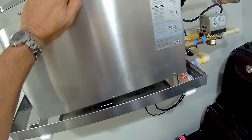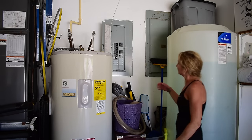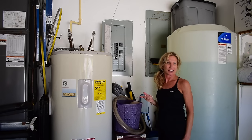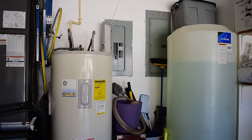Let's go in the garage and take a look at the breaker panel. The breaker is located in the left panel, not the one on the right. I know this is not good — you have the water tank in front of the panel. You're not supposed to block the front of the panels like that, but at least the door can open. Now, she told me it was a 40-amp breaker, but that heater, which is intended to have at least a 50-amp breaker, is only connected up to a double 20 breaker. Amy, how did you arrive at that being a 40-amp breaker? Very simple — this is 20 and this is 20, add it up, 40. It's still a 20 — it's just 20 at 240. The blonde hair.